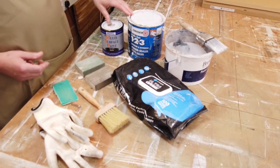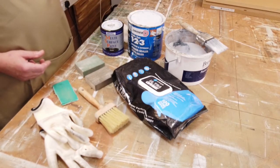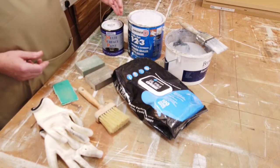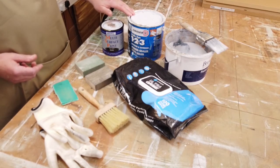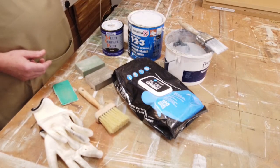This approach also means the color won't grin through as much. If you're using brilliant white as a primer and then applying a mid-to-dark blue topcoat, you'll need quite a few coats to cover the white. Whereas if your primer and topcoat colors are very similar, you may only need two topcoats instead of three. So before you do any priming, think about whether you need to color your primer to match your topcoats.